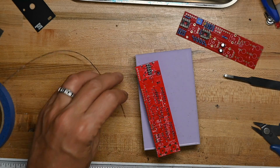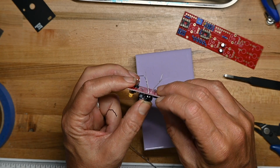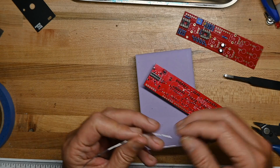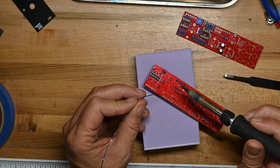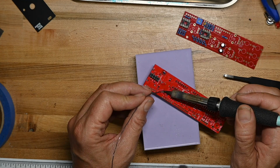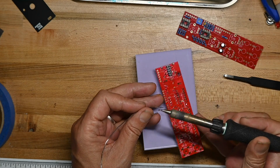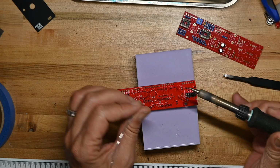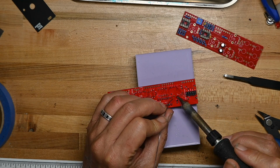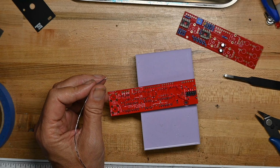Without pulling the leads out, because if you notice, it's just potted on this side, so it's possible, if you're too rough with it, that you could pull the photoresistor out of the case, and then you'd be very sad, because number one, you couldn't finish the board today, but number two, then you got to go find somebody who'll sell you a Vactrol, because I think there's only one company that makes them, and not every supplier carries them.